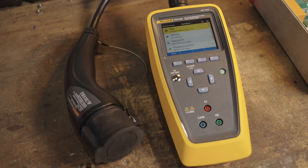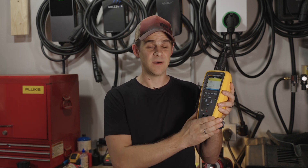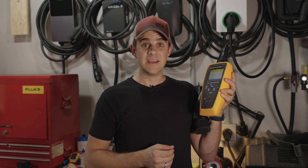So that's the FEV150. Who's it made for? Probably not most people. But if you're a technician out there working on chargers day in and day out, this is probably super handy because it has a bunch of things built in: the checklist, automatic testing, manual testing, and then looking at waveforms and voltages on the meter without having to have a second device — super convenient. You also have convenience features like the magnetic clip. It is pretty pricey, but if you are in the market for this, I highly recommend you check it out. Special thanks to Fluke for sending this along. Be sure to follow and subscribe, and I'll see you in the next video.